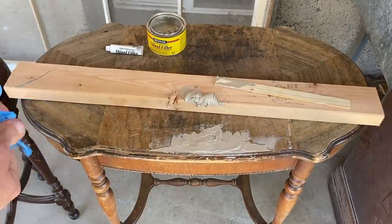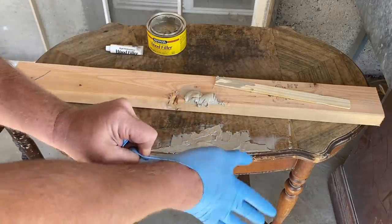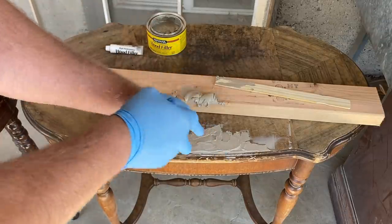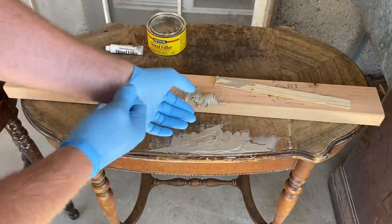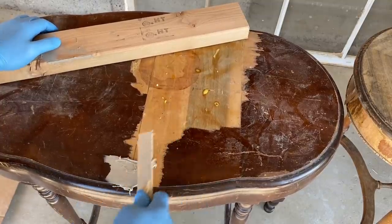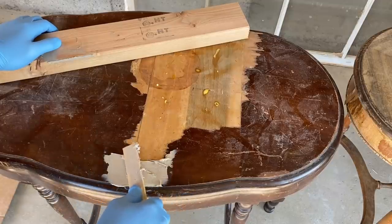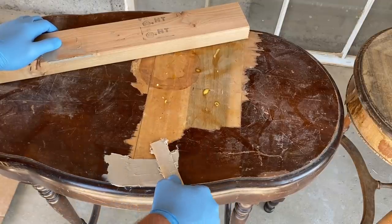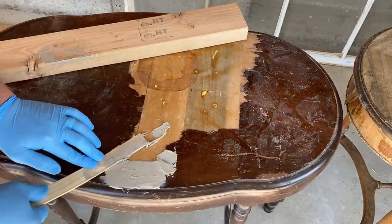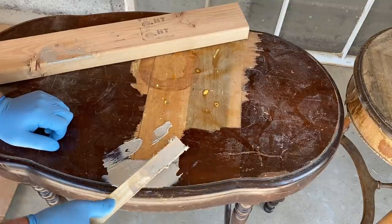The silly thing is I had gloves in my pocket and I forgot to put them on. Wear gloves with this stuff — it's sticky and gooey and it doesn't like to clean off your hands very easily. We're going to come over here and fix this one. I could remove this veneer and sand this whole top down, but I think bondo is the easier, quicker fix rather than soaking it and fighting the veneer for a few hours. I'm just going to bondo it and sand that flush.